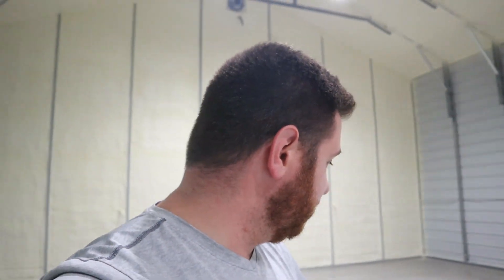Some of you might wonder why I didn't do epoxy. Epoxy does look great — a gloss white epoxy in here would look badass — but the process is more in-depth. Epoxy more than likely requires etching or grinding the concrete for proper adhesion. The other thing is I'm working on this when the kid's napping or on a day off. I don't have enough time for the full epoxy process. For the price point this stuff was a much better idea — super easy to put down, did it all myself in just a couple of hours of cleaning and a couple of hours rolling.